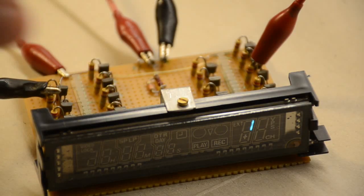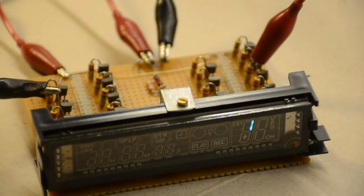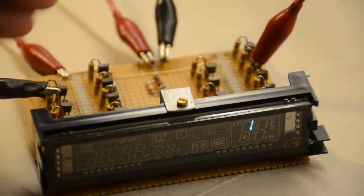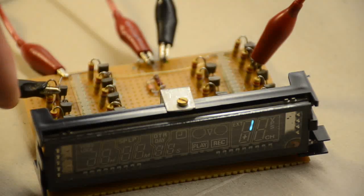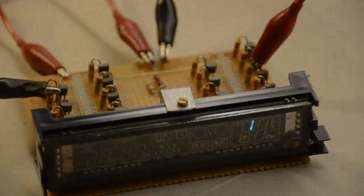And obviously if you just want the one digit, you connect up the grid, and then moving this around will give you all of those 7 segments of the display plus the extra bits if you've included the interface transistors for it. If you want 2, then you would have to multiplex between changing the grid here. You'd need 2 of them connected up, so 1, and you scroll through the bits you need for that digit, then you go to the next one, and obviously the computer or whatever will do that really quickly, so you just simply see the 2 digits up at the same time.